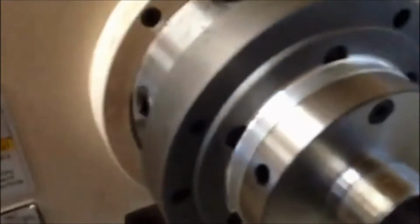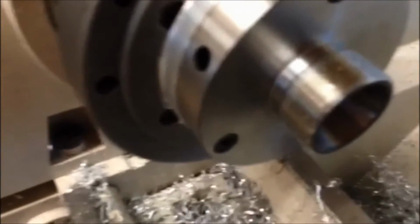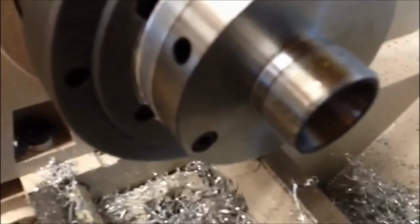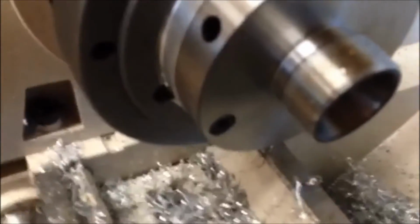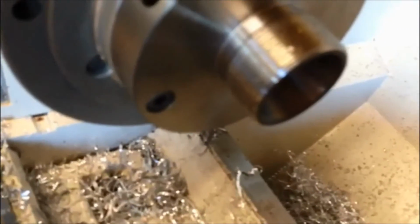I'm using the iPhone. Basically, what I've done is I've made the register a little bit loose to compensate for the machining. And I took an indicator to right here. Now I know you're supposed to be that dang close. If I can get the spindle within a half a thousandth, I'm going to live with whatever runout I got. If I need it to be any closer than what I'm going to use it for, folks, I'll indicate the part in there. Excuse my French, but that looks pretty good to me.